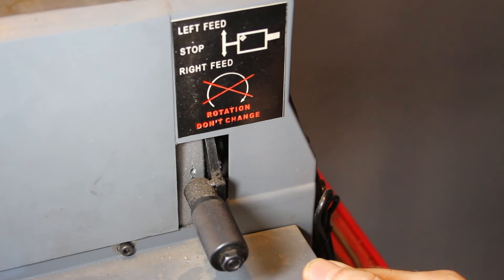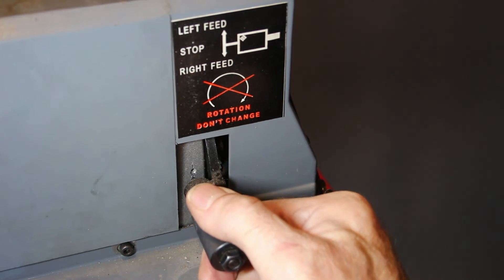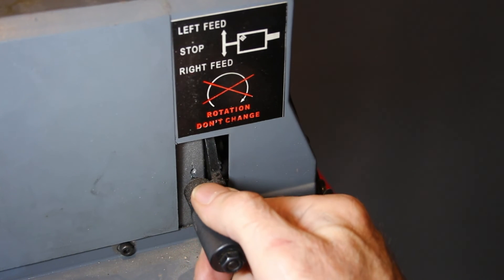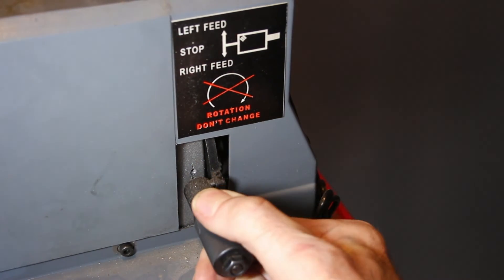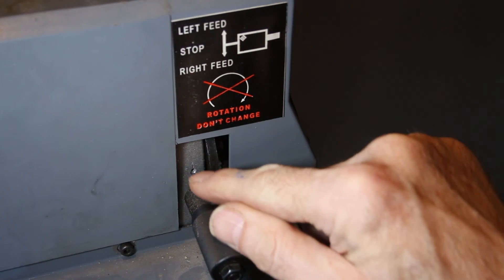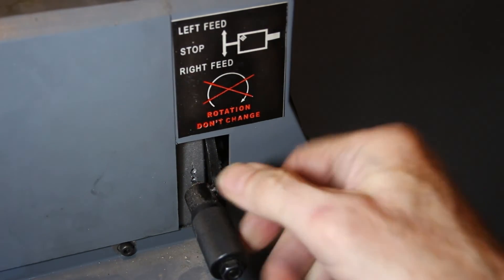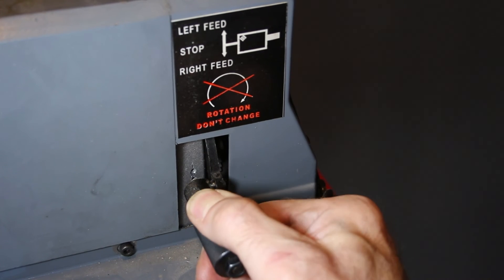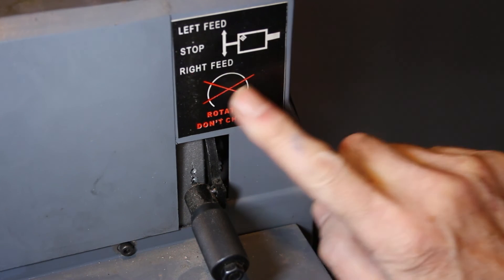On this particular machine, which I believe is a standard C3 machine, the direction of the lead screw that drives the carriage is changed by this lever here. You pull it out, drop it down there for reverse; pull it out again, drop it back in here for neutral — as in non-driven; and then this is forward, as in moving toward the head. I found that there was no locking hole or detent in there for this pin to drop into. So I drilled a hole there and made a detent so it positively locks into neutral, because originally there was kind of a flat surface and it could accidentally drift down into the wrong location — and that would be really bad. I find this really quite charming, actually.